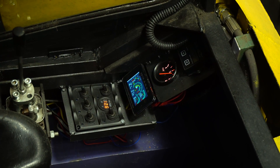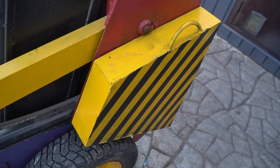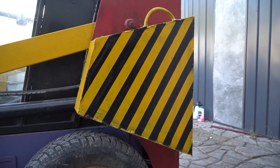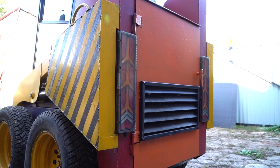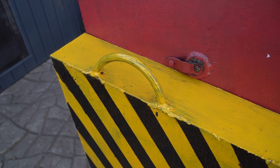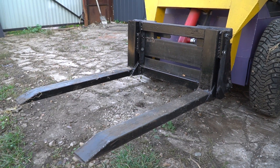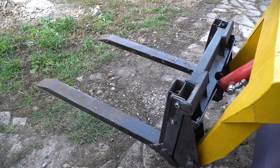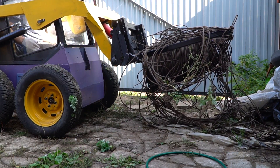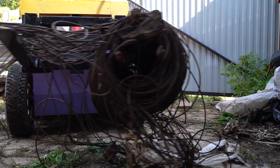Now I want to tell you about the improvements and attachments made during the year of skid steer operation. First, I made counterweights for the back of the loader — just a steel box filled with concrete. Each counterweight weighs 60 kilograms and they are removable. The first attachment I made was a fork: I welded a quick-release platform and fixed the fork on it with bolts, which is made of shaped tube. It's a very convenient thing — you can transport almost everything with it.